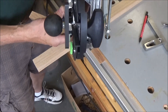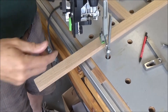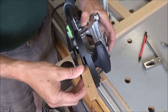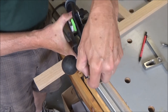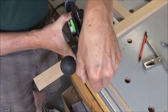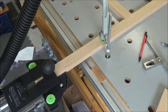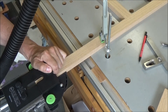I'm using both setups here — the jig from the Festool that holds small workpieces centered. I've got that adjusted, but I've got some slop in one direction. I want to make sure it registers off this plate and doesn't get affected by this setup. It'll be down tight to the workpiece, and then I use those fences to get my adjustment right to my center line so I know I'll get a good cut. It's just a matter of careful measuring, marking, and then making your cut.